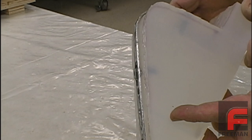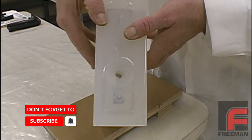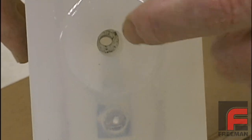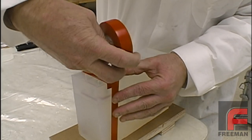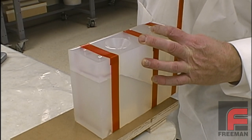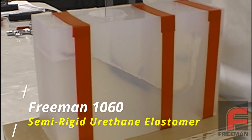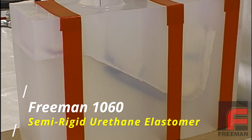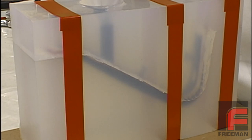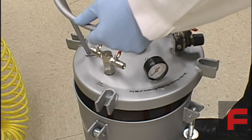Since we don't want the threads to be covered in urethane, we secure plastic sleeves around them. Notice the space between the core and the mold where the urethane will flow. In order to make sure the material will fill the entire mold, we drill a hole through the core. This will allow the material to flow to the bottom side of our core and not just the top. Next, we assemble the two mold halves and secure them with electrical tape. We are using electrical tape because it stretches and therefore it won't deform the mold as a much stronger tape might. Next, we pour our Freeman 1060 semi-rigid urethane into the down-sprue. Note that this material has been vacuum degassed to ensure a virtually void-free casting. We fill the entire cavity including the pouring sprue. This excess material is necessary to accommodate for the added pressure while curing and slight material shrinkage in thicker sections. After filling the mold, we put the mold into a pressure pot to cure under 15 psi of pressure.